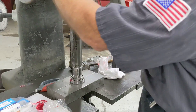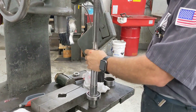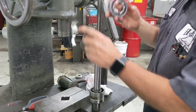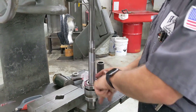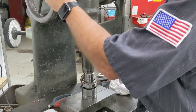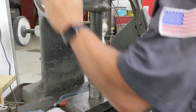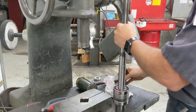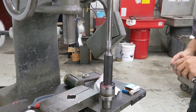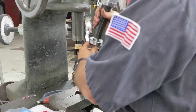Pull it back out and put our spacers on — the inner spacer, then the outer spacer. Put on your other bearing; same thing, the thick side of the race is going down. The bottom one goes up, the top one goes down. Just try to keep it centered. You want to make sure it feels like it's going to be on there snug. Pick it up again, put on our top spacer, then open up our upper bearing and slide it down on. Back in our fixture. Now we're ready to go back over to the vise.